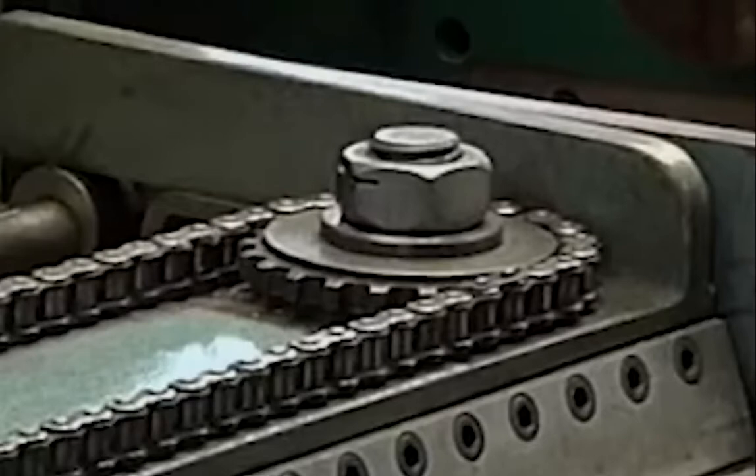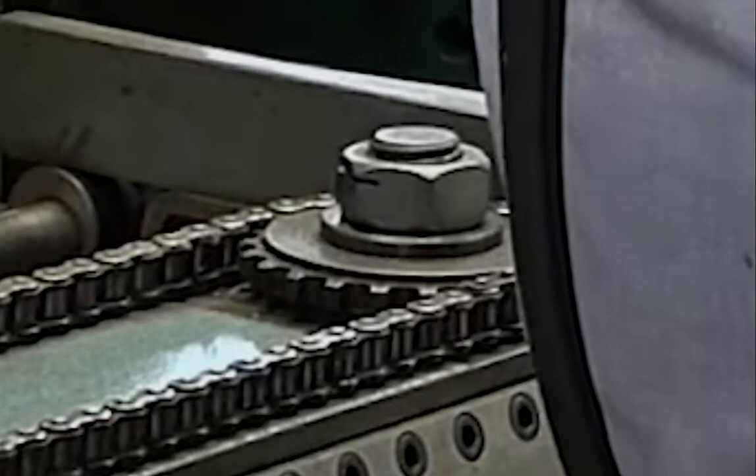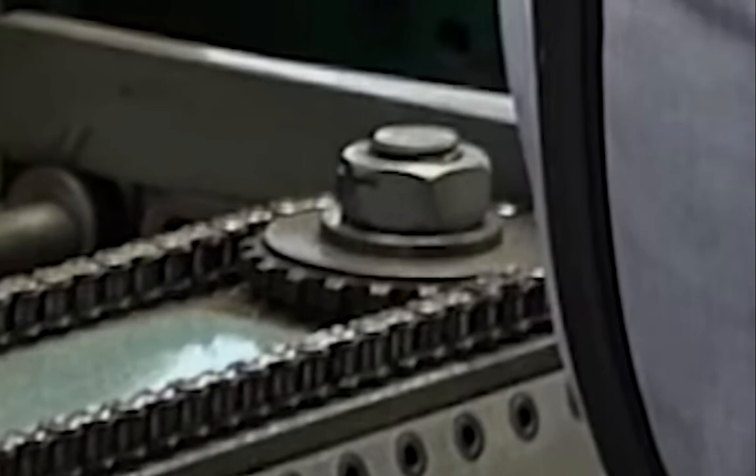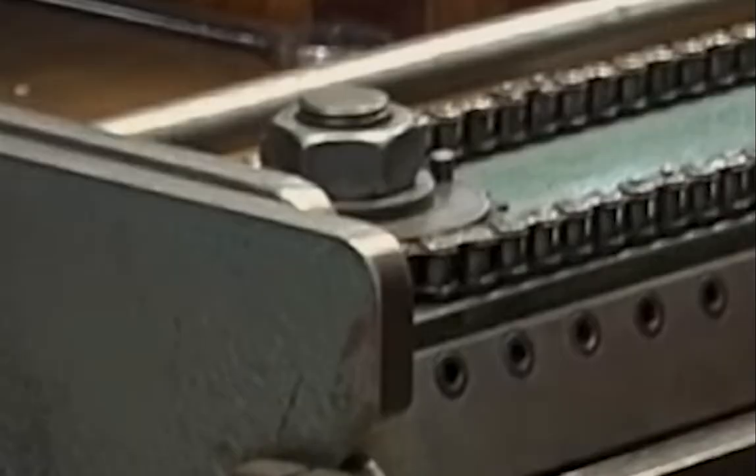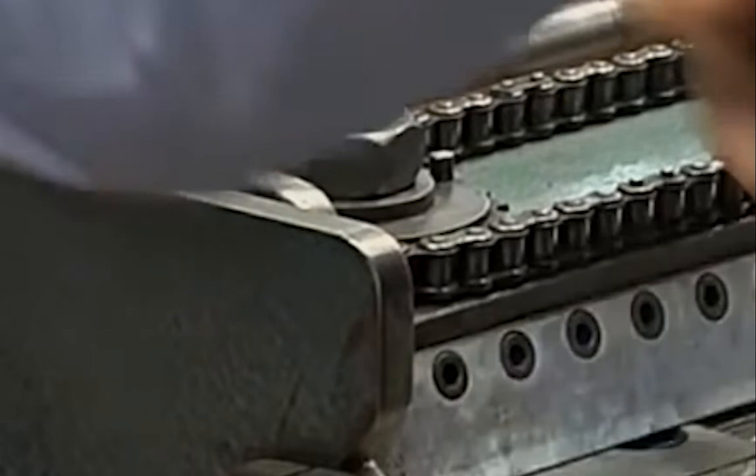Also, if you look at the nuts, there's some kind of set screw, some kind of slot in there. From one section of the video to the other, those nuts actually rotate slightly. So if it's too hard to do the clamping pressure, he can probably adjust those nuts, and he'll lift the entire plate up and down to accommodate thinner or thicker material.